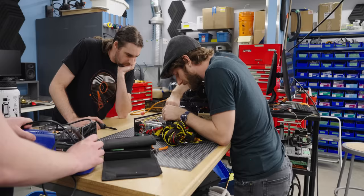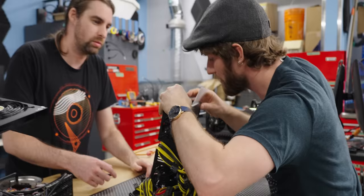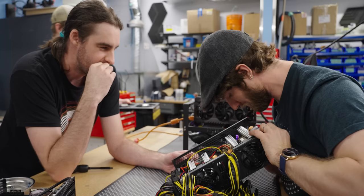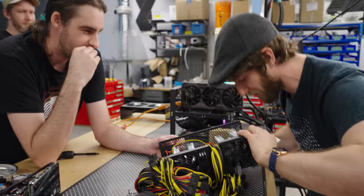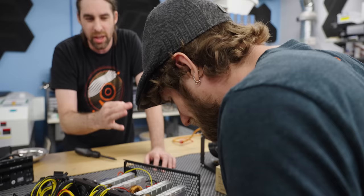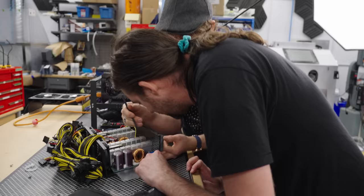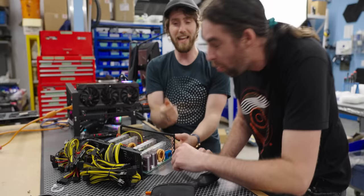The ground wire of the low side here is connected to this board as well, and there's a very sketchy heat pad on the bottom. Neither of them are through the board — they're both loose. I broke nothing; it was already broken. I think we should teamwork this. It's really easy to find which holes we're targeting because they are the ones with no legs coming through, compared to the other side where you can clearly see the legs coming through the bottom.